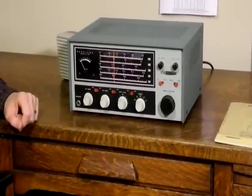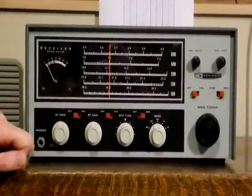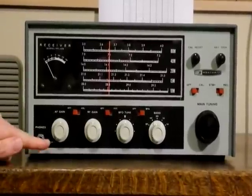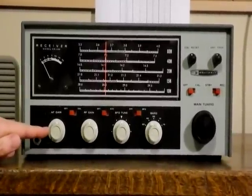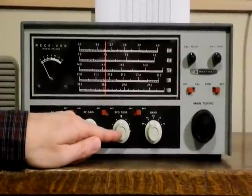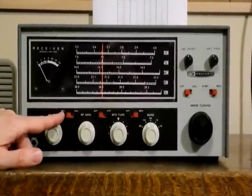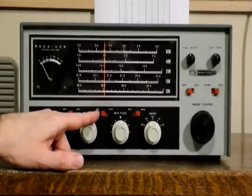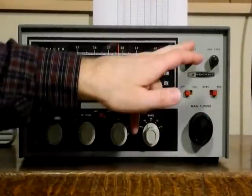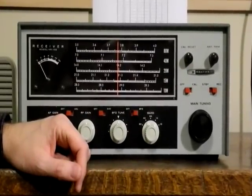Let's take a look at the front panel. On the front panel, starting from the left, we have the headphone jack, which cuts out the external speaker when a headphone is inserted, the power and audio frequency gain or volume control, RF or radio frequency gain control, VFO tuning, and the five-position band switch. Switches here for turning on and off the automatic noise limiter, the automatic volume control, and the VFO. We have the main tuning knob, and controls for antenna trim and adjusting the optional crystal calibrator, which I'll cover momentarily.